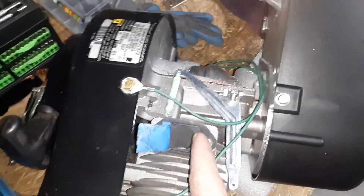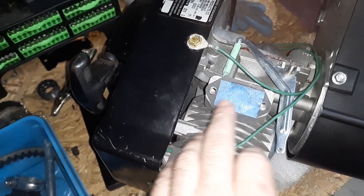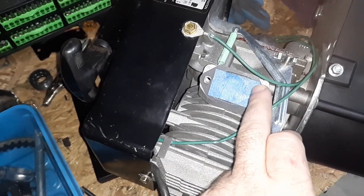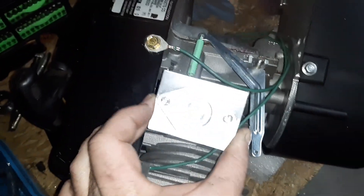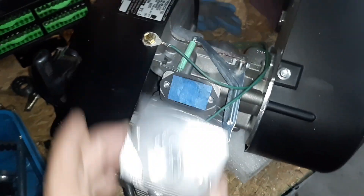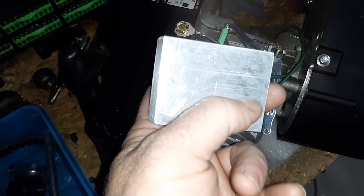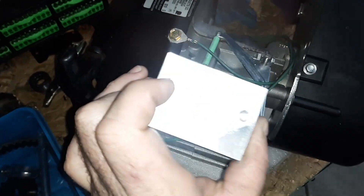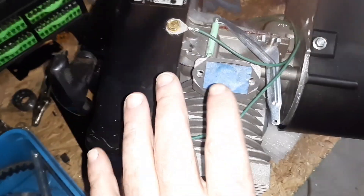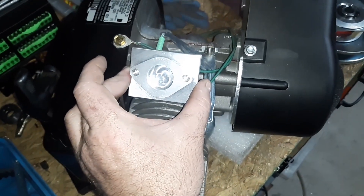By having that pattern, at least I know I can put a motorcycle intake on it and go from there. I can literally cut this all the way along that line around. That's the big thing people don't realize — the intake wall is actually only about an eighth of an inch off that screw hole on each side. So that's the reasoning for this. I'm gonna make a whole plate. Now I have something manageable that I can mount the carb to. That hole right there, by the way — people were asking — that's 32 millimeter. We're gonna cut the right one there, and then we'll bevel everything on the inside so it's all nice and sloped for good flow.